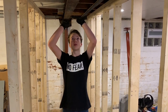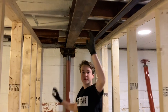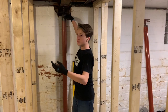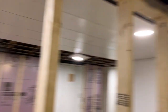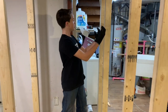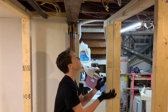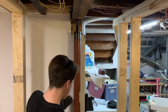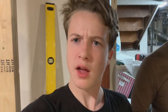We just finished putting the beam up and supporting it with these jacks. We lifted this side up and put it on that ledge, then came over and propped it around the shelf — which was a little bit difficult. We put it up on that ledge, slid the jacks in, leveled up the jacks, and re-seated it.